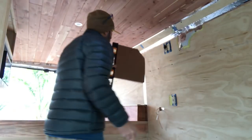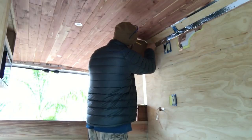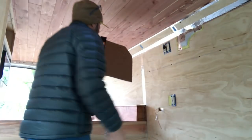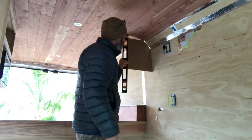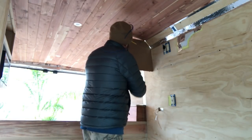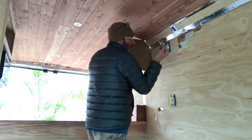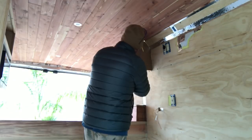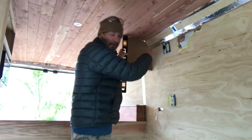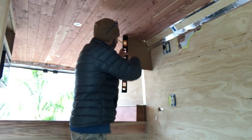So I'm going to go cut that off. That's a little bit better. You just keep going — I'm watching the little bubble to make sure it's plumbed — and go cut it off again. I'll probably mess this one up and have to make it again, but every time you do it, it gets a little bit more refined. I'll probably start to use a belt sander to do really fine adjustments — you're talking like a thirty-second of an inch. So I've got this contour down. Now I start to work on the top contour. I just set the compass to the widest spot, draw that out, and cut that off.